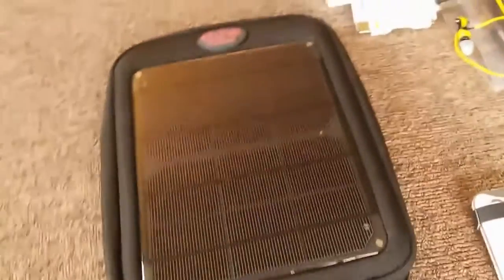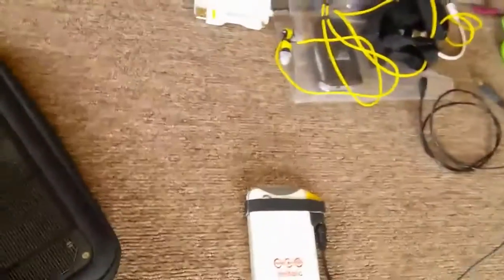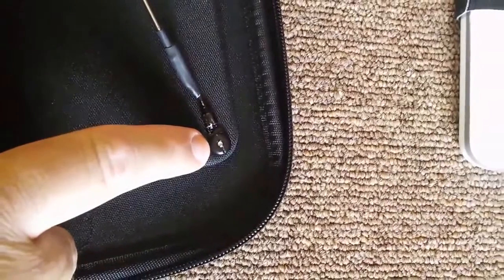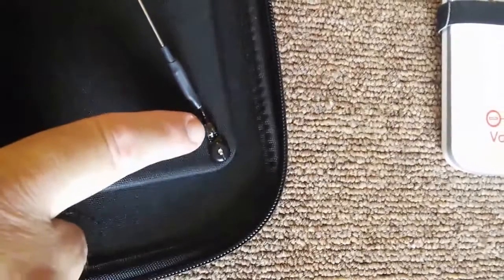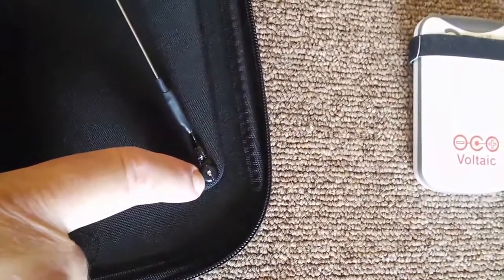The third hack: these work best when you point them straight at the sun. When you lift this up, there are some gores on the side that keep it from opening all the way — you can remove them, they're just Velcro attached. But how do you keep this thing up in position? What I did is I took a bicycle spoke, cut it to length, and up here is just a ring-type electrical connector with a short piece of wire. The wire is soldered in and covered with heat shrink tubing, attached underneath the post-stud retaining nut.